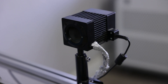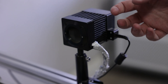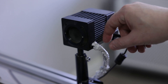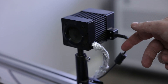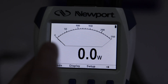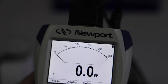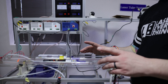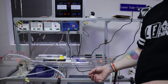Here's our target, which is essentially a ceramic plate with a whole lot of heat sinks to pull as much power away from the target area as possible. There's aluminum foil as protection in case we accidentally hit any wires with the beam, since CO2 will cook right through plastic. All we're doing is firing from the tube and hitting the target. It generates heat, which gets read and calculated into the output wattage. The higher we go on the meter, the more wattage we're putting out. As we turn up the milliamps on the power supply, we should see a higher reading.